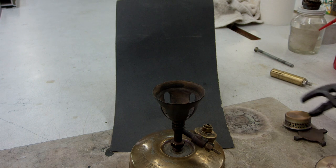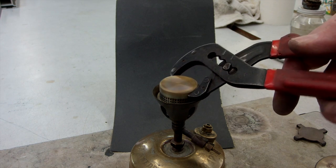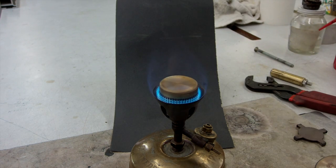Let's do another hot swap back. It starts out nice and blue and then just develops that yellow, which tells me that it's not a fuel issue — it's a contamination issue. Anyway, if it's the flux, it'll burn off in a while — half an hour, an hour worth of using it and it goes away. If it is the brass, then you're probably looking at being stuck with kind of a yellow tinge. But right now it looks great, so I can't complain about that.